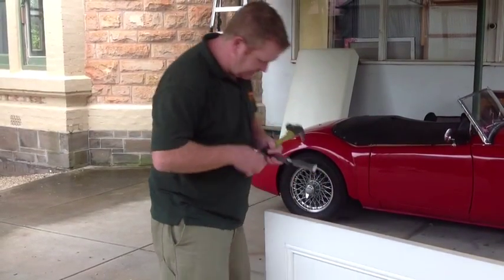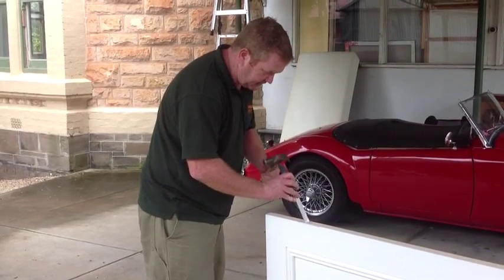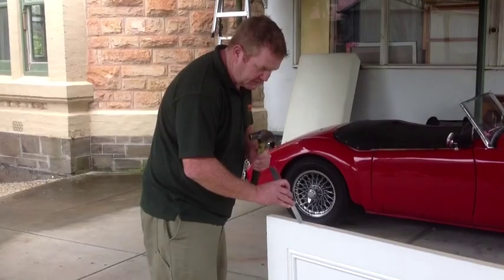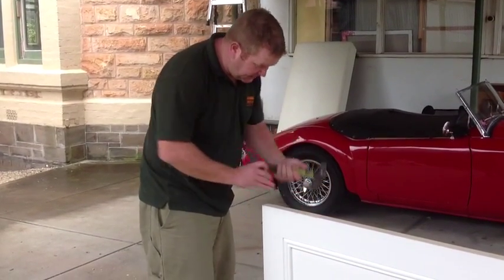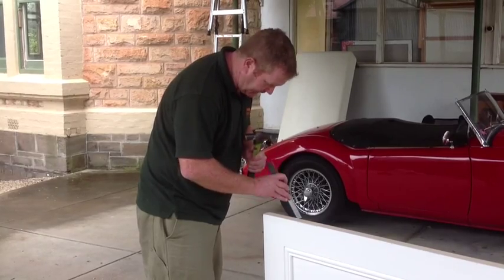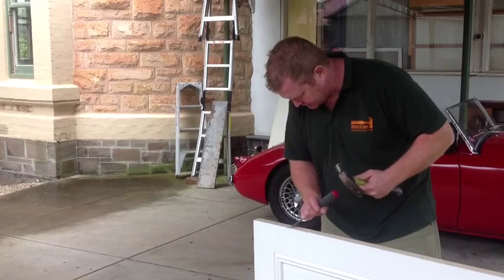So that's just the theory of that one. Nice, good taps there. Nice and close to the cut. If you're doing it quickly, you don't need to go too close to the cut line. This cut line along here, that's okay, because when we chisel out, we can do that again. I can't stress enough, have a nice sharp chisel, because all of this is made much easier with a nice sharp chisel.